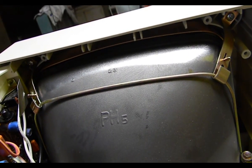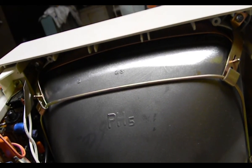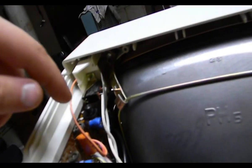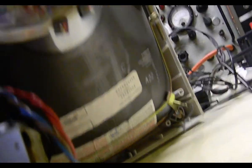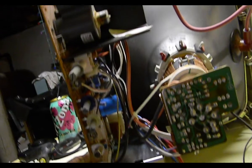So as you know, I have no service information for this. We're going to start with the easiest possible things first. I'm going to look for any physical connections that are iffy on the PCB itself, and I'm going to clean and rotate every variable resistor on the unit itself. And I don't remember this having a red pasty glue there. Actually we can check to see if my memory is wrong because I still have the CRT and faceplate to my old one. This one has brown glue on it, and a Philips CRT. Philips as well — yes, because Philips bought out Magnavox.